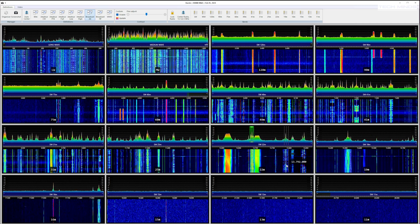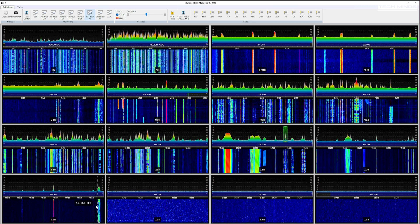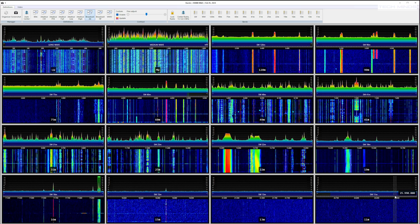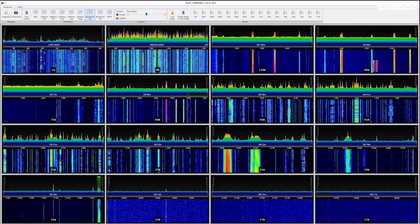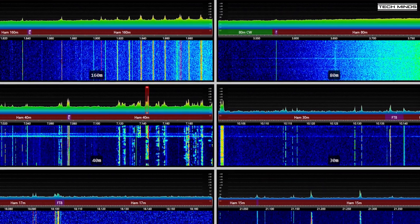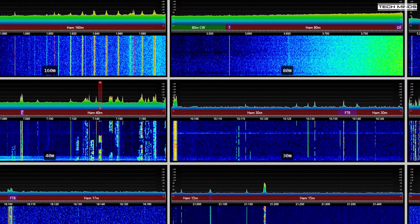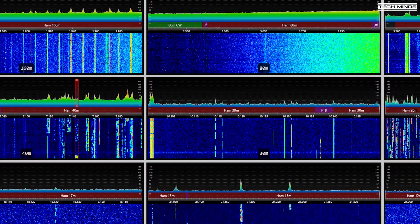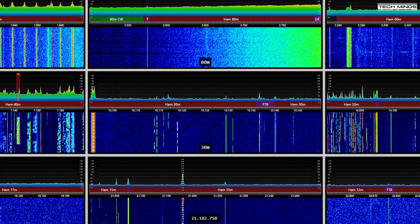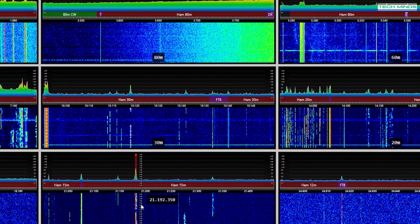You can set SDR Console to have separate receivers, each with different audio outputs via virtual audio cable. That's a cool feature if you want to set up a digital mode skimmer that receives, decodes, and uploads to receiver sites on modes like FT8, or if you want to monitor each band's SSTV frequencies so you don't miss any SSTV transmissions. There are many more things you could do — as we're using software we can pipe audio out to any application to decode it, record it, or do whatever we want with it.